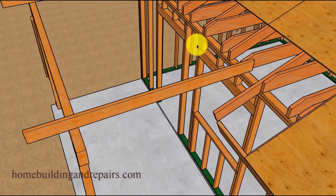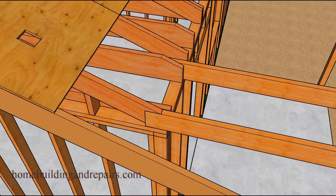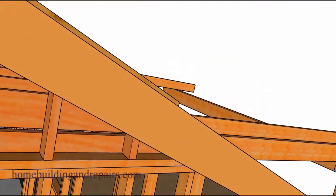Now let's take a look at the connection where you will need to make sure it is lapped on the correct side of the ceiling joist — I actually built this model and had them lapped on the wrong side. Here is another cut you might need to get creative with: you can install the patio rafter and then notch around it, or just have the patio rafter sitting on top an inch and a half or two inches. Keep in mind that the minimum distance a rafter can sit on top of a framing plate is probably going to be an inch and a half.